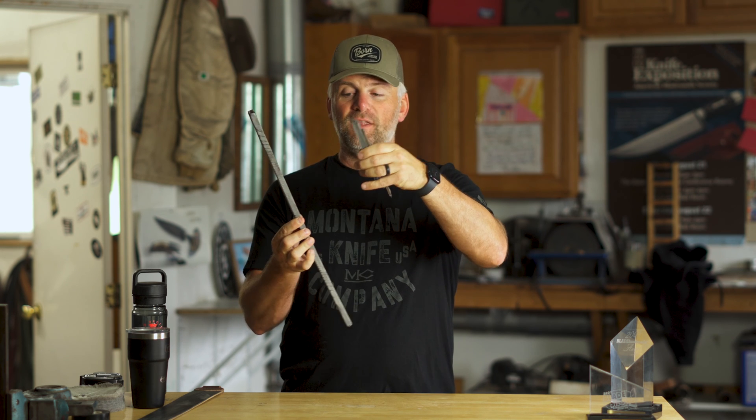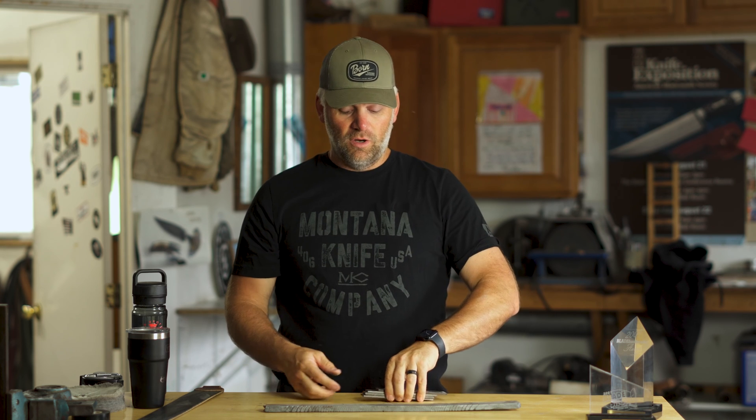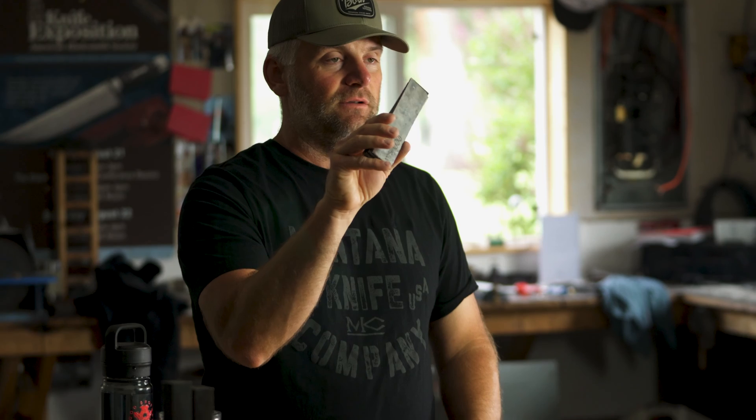Damascus Steel goes all the way back to the old days. The reason they made Damascus back then was that you didn't just go buy a great big bar of steel and cut something out of it — maybe all you had laying around the shop were small pieces of steel, but you needed to make something much longer. By forge welding those pieces together and drawing them out, you could make something big out of a small stack. It was a very efficient use of material, and you could also forge a big curve — maybe making a spring for a horse-drawn buggy, or a sword — all out of a small stack of steel like this.